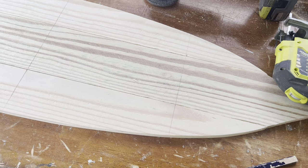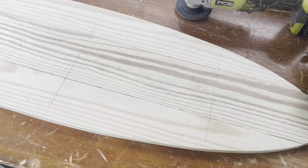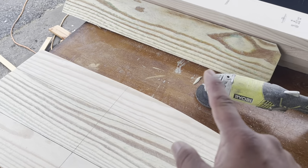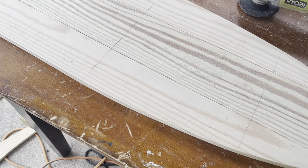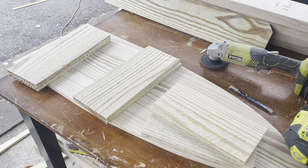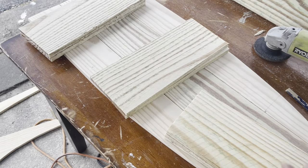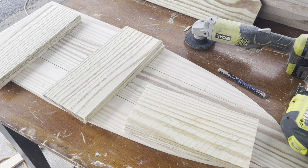So that's two pieces for the lower shelf, two pieces for the middle shelf, and two pieces for your base. For the depth of my shelf, I'm just going to make it the depth of a fence picket — you can make it as deep as you want, but for this example we're just going with the fence picket depth. With that said, let me go ahead and cut my shelves. Now I have all my shelf pieces cut — we're just going to take some wood glue and some one-inch narrow crown staples and staple these two pieces together, then attach them to the back of our shelf.